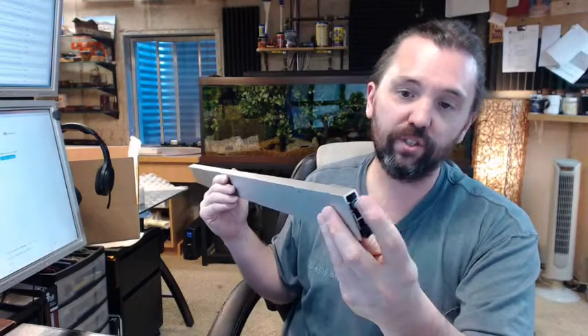Automatic door bottoms — we talked earlier about how this is the hinge side. When this is attached to the face of the door and this plunger is depressed, which is the action of the door closing — and by the way only on the push side, you can't install it anywhere else. You have to install it on the push side so that when the door closes, this will come in contact with the frame. As you continue to push the door closed, this has nowhere to go but in. The plunger can be turned counter-clockwise for more projection from the edge of the housing, or clockwise to turn it in. The amount it projects is directly related to how much distance you are asking it to drop.